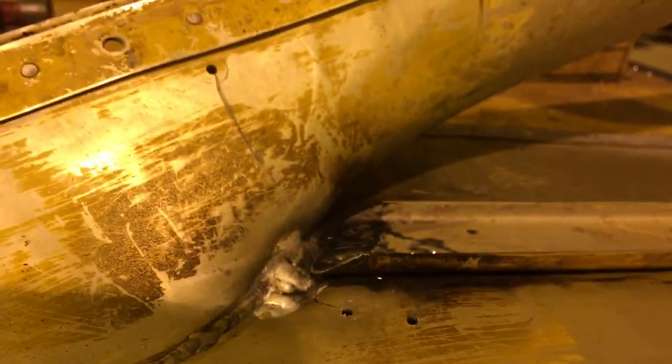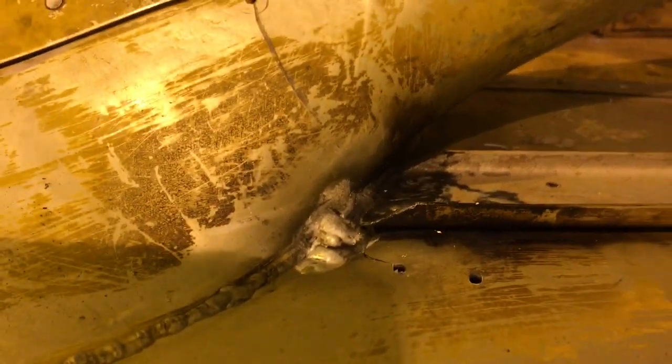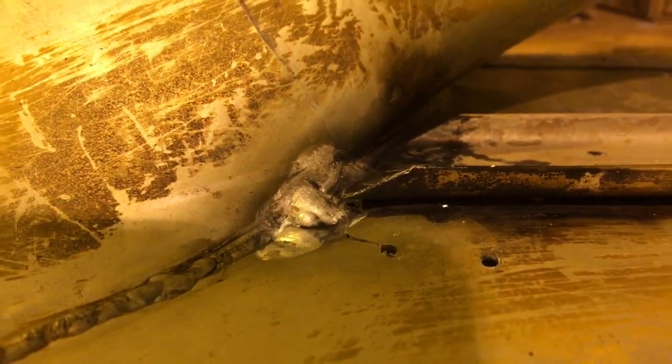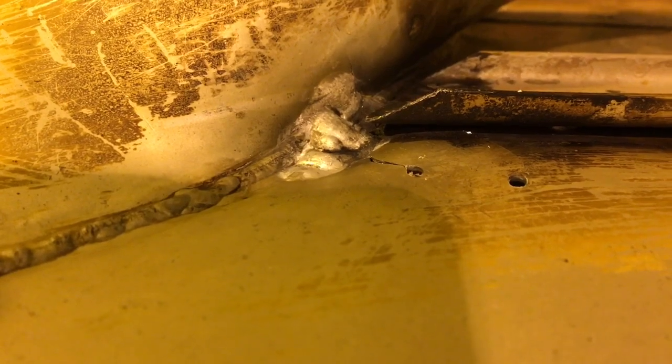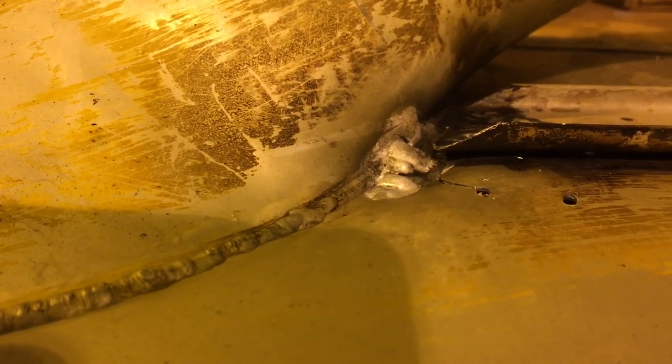Just a note: it's off one of our communist friends' aircraft. If you're thinking about doing stuff in your home shop to earn a bit of money, note that it's covered in crap and someone else has already had a go at it unsuccessfully. We also don't know what the material is — no spec, no identification marks — and it's covered in probably a chromate alodine substance, unlikely to be very nice, especially as it came from the former Soviet Union. So we're going to get all that off first.